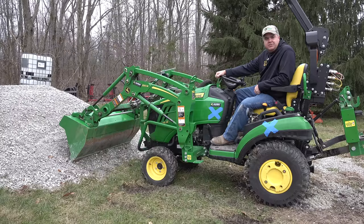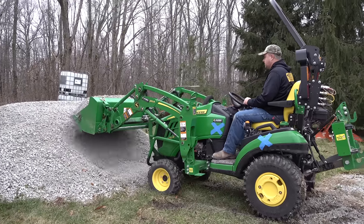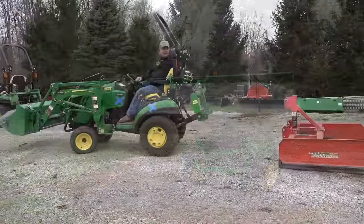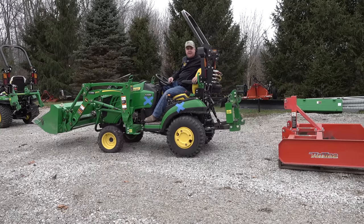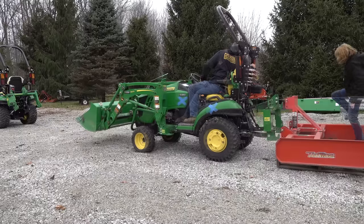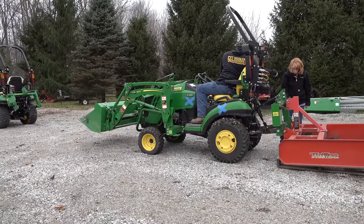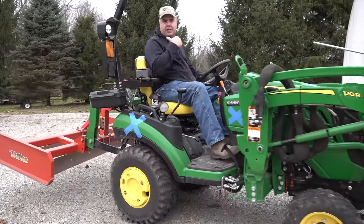I'm going to put the land plane on this machine, just see how it feels. Going to get a bucket full of rock and put it out in front of the trash dumpster. Even with the rim guard, we need this blade for ballast. I see so many people that try to use these subcompact tractors without ballast — I just don't understand. It still doesn't feel like enough ballast. If I do much work with the loader, I put something heavier than this blade on.